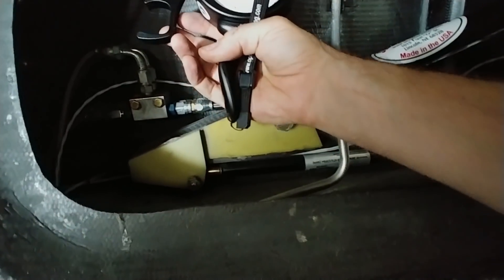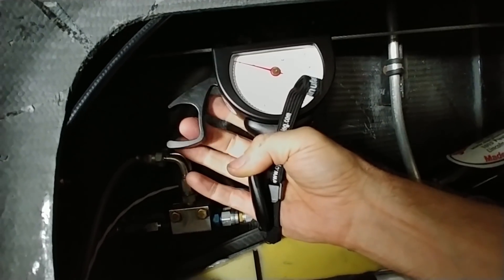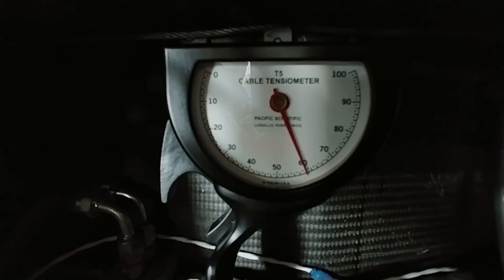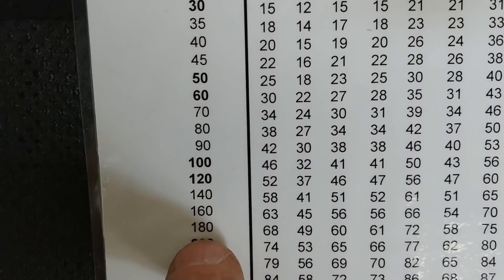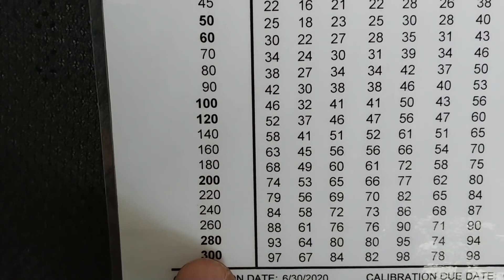This gauge allows me to go up to 300 pounds; the other one was only 75. The cable is rated at 2,000 pounds and so are the pulleys, so as long as everything else holds together I can run 300 pounds on this all day. You just clip it on the cable and pull the lever shut to put tension on it. It's showing 60 on the gauge. Going down through the 1/8-inch column to 60 and then across the translation table, that says I have 180 pounds of tension on there right now, which is fine.